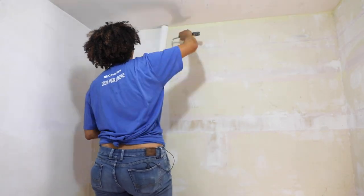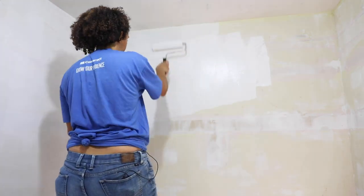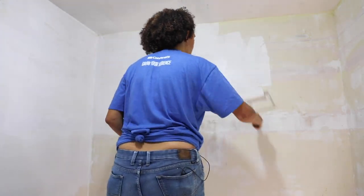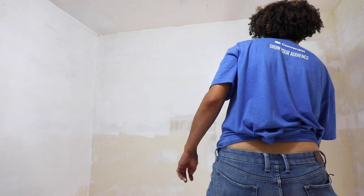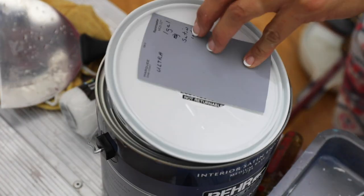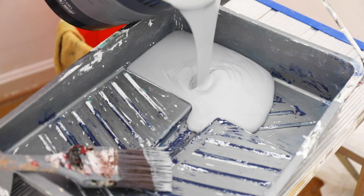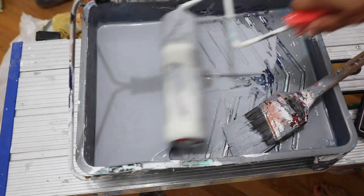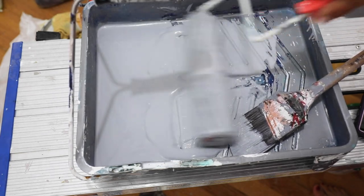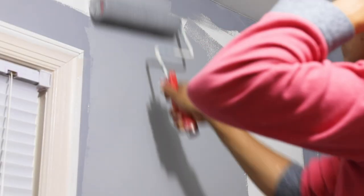Once the walls are clean, it is time for the primer. You might be wondering if you're using a regular paint that has primer in it, do you still have to prime? In this case yes, because joint compound is very drying — it will suck up your paint and leave dark spots all over your wall. So don't skip this step. Definitely do two coats of primer. Now let's talk about the paint. I let my son pick out the paint color. While I like the color, it's just not the color for me or this closet — it's a little too masculine. I like things more girly: pink, purples, turquoise. But he picked it out and I went ahead and finished painting it.